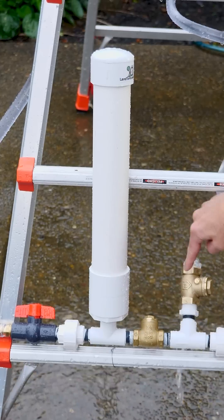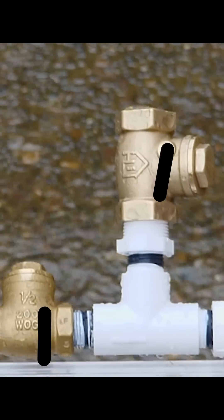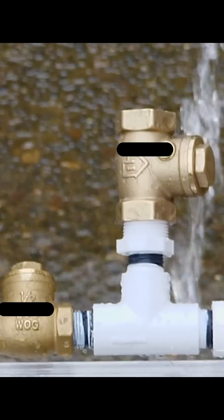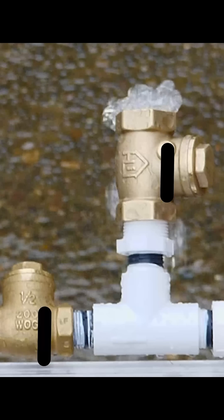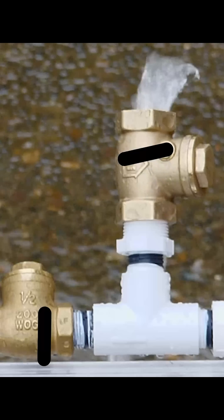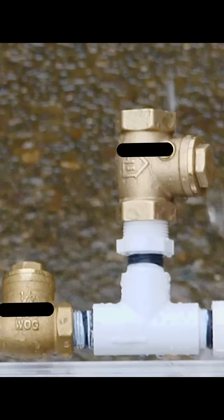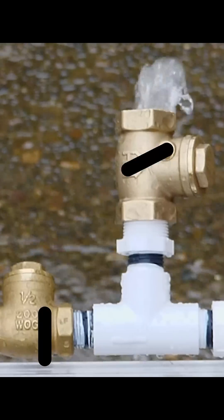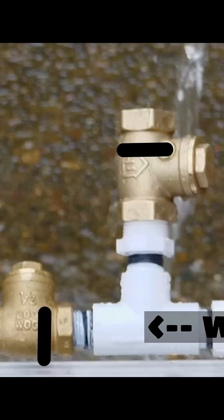The working pieces are actually this valve and this valve right here. Without them it can't work. The valves moving inside look like this. These valves opening and closing occur naturally, and the frequency depends on how high your bucket is and how high your outlet of water is. You start the pump by holding down the waste valve so water begins flowing out of it. As water flows out of the waste valve, it catches the flap and pulls it shut. But the water that was moving through the tube suddenly got slammed to a stop, and it had kinetic energy that has to go somewhere. That kinetic energy gets turned into high pressure in the tube. Then that high pressure opens up the second valve and forces water through it. That little bit of water that squirts through releases the pressure and the valves return to their initial positions and start over again. This process will continue as long as you have water coming in the inlet and the pressure on your outlet is not higher than the spike pressure when the valve closes.